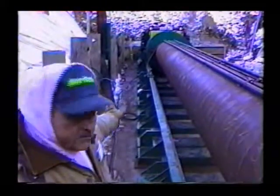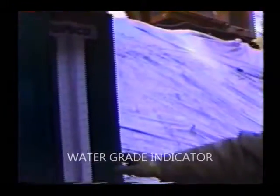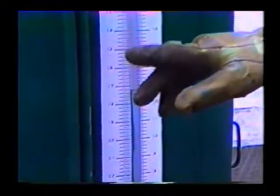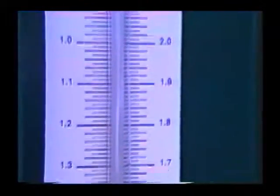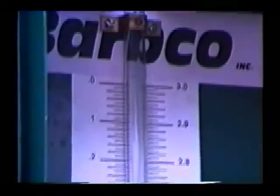We're going to utilize a standard grade indicator. We added an extra long hose and we're going to go up 0.5% grade. We've extended the sight tube up and we'll put an engineer's ruling up on top so we don't have to move this and we'll be able to continuously run the grade all the way through without moving the grade indicator box. We have windshield antifreeze in there — it makes it a little bit easier to read, and we've done it to prevent from freezing.